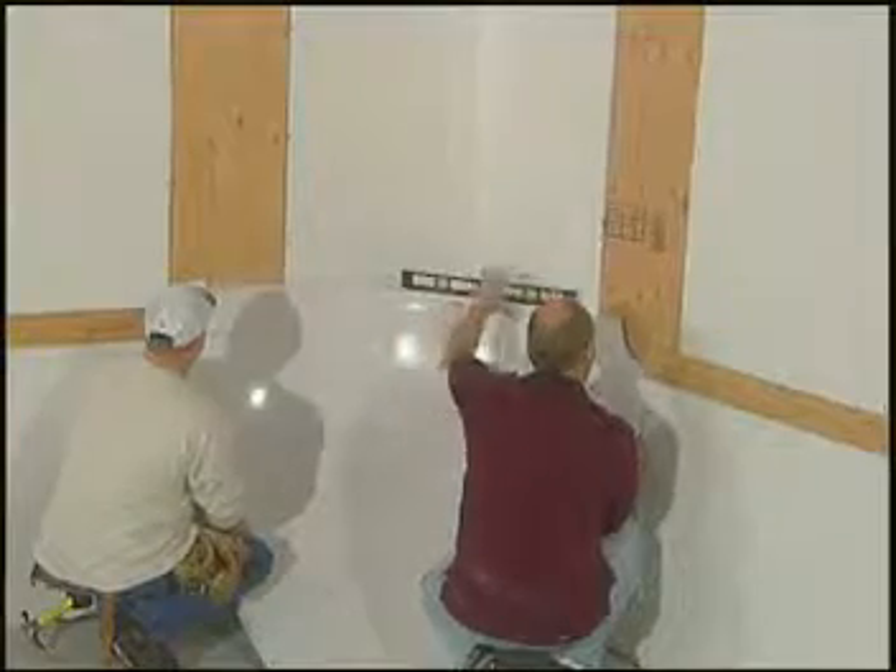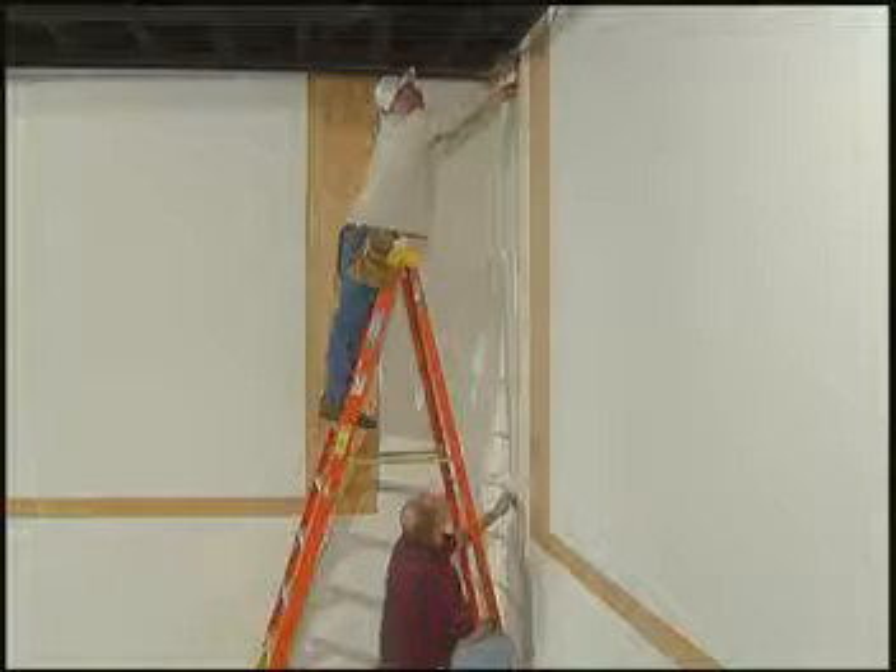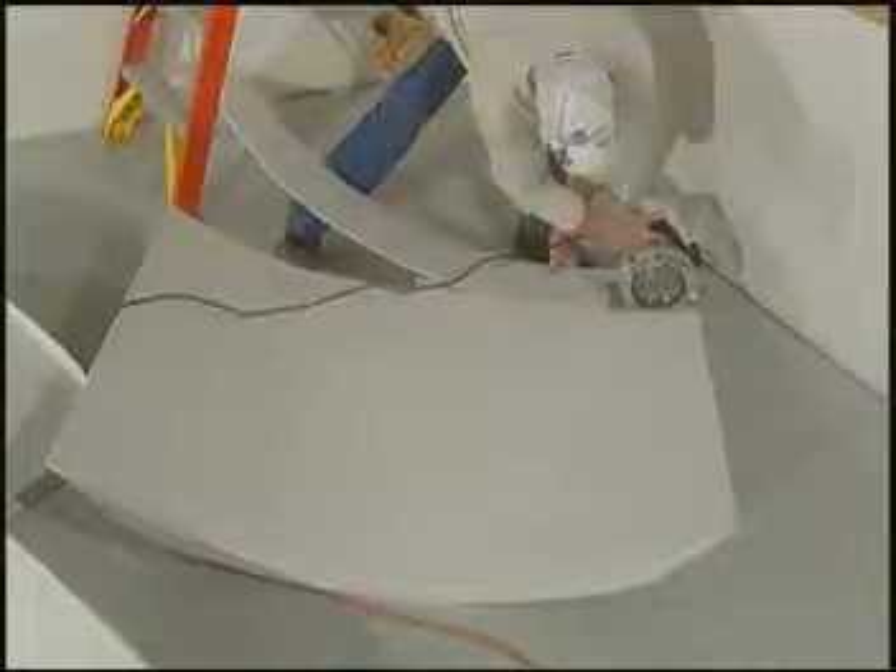The top of the corner cove unit is 41½ inches from the floor. We mark this with a level and then verify it with the corner unit. Then we measure the distance between the ceiling and the corner unit. In this case, we must modify one of the upper vertical modules to fit the available space.